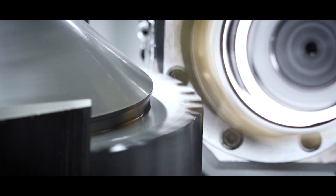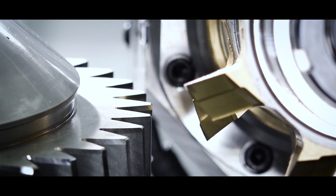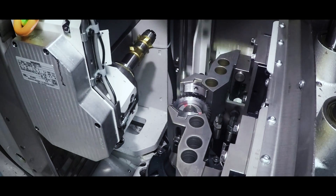The chamfering is done by using special cutters, the so-called chamfer cuts. Due to the cutting principle, a very high accuracy and repeatability is achieved. No material burrs or deformations occur. The additional second cut in hobbing when using press chamfering is eliminated. The principle was established over 10 years ago by Liebherr and is known for its high tool life.